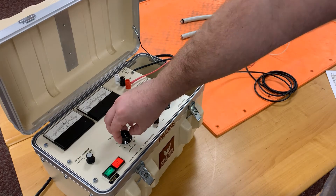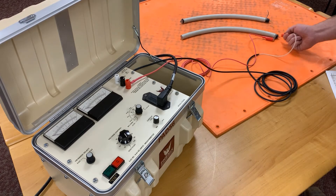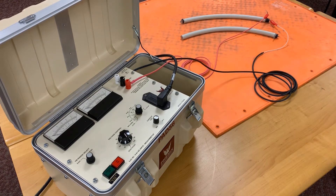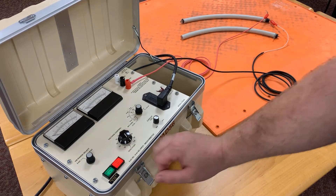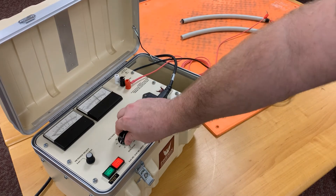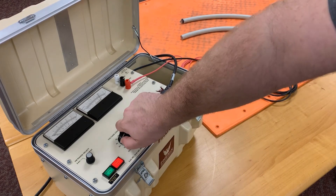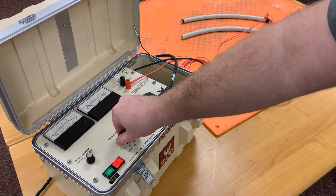We'll go ahead and run that back down, turn that off, and turn the unit off. We'll select the other piece of x-ray cable, which has the shield tied to the conductor inside the cable. We'll turn this one on and this will immediately begin drawing current as you can see on your current meter above. The current trip on this has a buzzer built in, so if we turn it up and reach the point that it trips you will hear the buzzer and the unit will turn off.